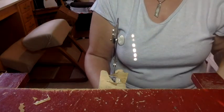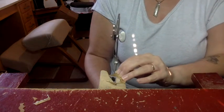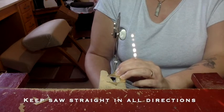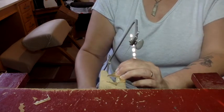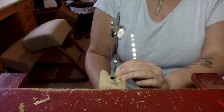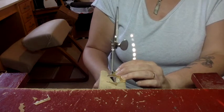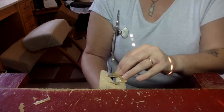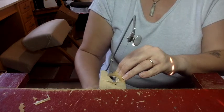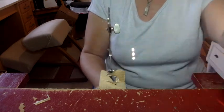When we get down to sawing the different lines we'll talk more about this, but the last thing — you're lined up, you've got a nice blade, your metal's on your bench hook — is you've got to keep that saw straight up and down. You do not tilt left, you do not tilt right. That's the worst thing you can do. You also don't want to tilt forward or back. Tilting left and right and tweaking that blade is going to snap it every single time. So if you're snapping a lot of blades, you're probably tilting your saw left and right — just be aware of that.